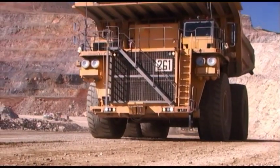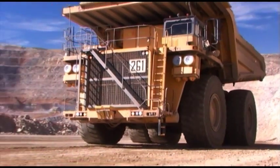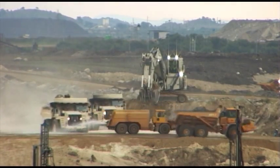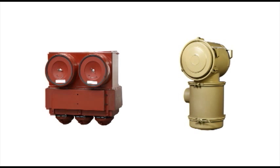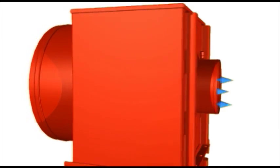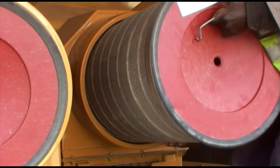This group includes heavy-duty workhorse two-stage air cleaners designed for severe dust environments, including conditions encountered in construction, mining, and other off-highway applications. The air cleaners in this group, the SRG and the STG, are the most commonly used air cleaners in these applications. These axial seal units feature low restrictions so the engine receives a high volume of air, and sturdy, vibration-resistant, long-life construction.